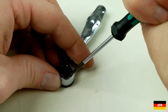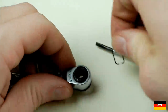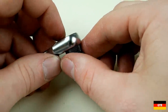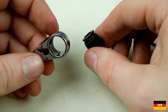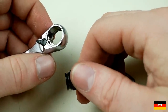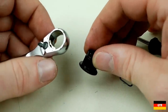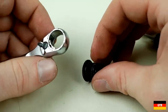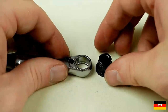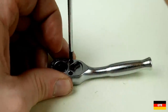The Vera unit was the most difficult of the four to take apart. They use a clip with dual functionality — holding the ratchet together as well as holding the bit in the holder. With parallel edges, it mates with slots in the drive to contact the inserted bit. It's an ingenious cost-cutting approach, but I'm not a fan because it allows a lot of movement in the drive with no active lateral force. Once apart, the materials used for the drive were extremely thin, raising concerns about longevity. I gave the Vera a 7 in this category.